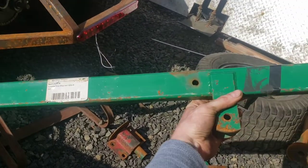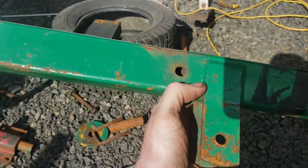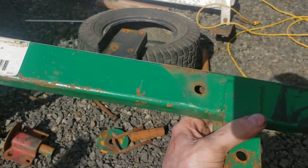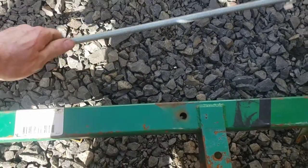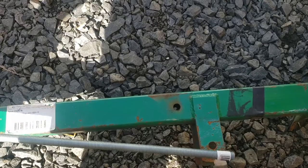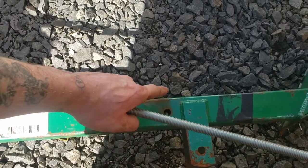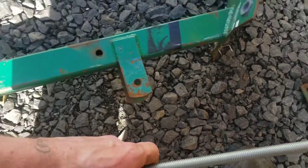So I think I'm gonna use this rod and let's make us a bender. I'm also gonna cut this piece down because the other piece I've got here will fit over this, and I can use a bolt through that hole for one of my pivot points. I can see that this rod to that hole is about the right thickness, so I'm gonna get to cutting this off, maybe even radius it so I know I can rotate that around it really easy and nice.